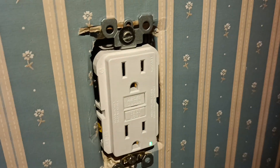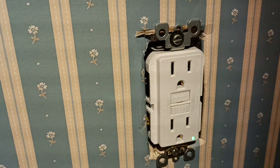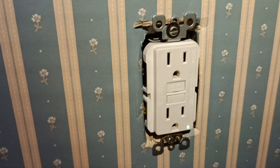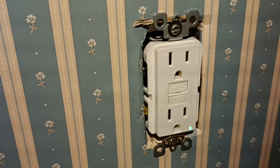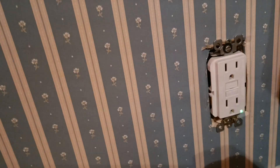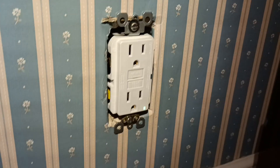Why would you want to put in a three-prong grounded plug instead of using just an adapter? Maybe you have a plug strip that needs a ground, or something that's requiring a ground. If your home was built before 1970 — I believe it was around 1970 or 1971 when they started requiring grounds on receptacles — your home would technically be grandfathered and you don't need to do this update unless there's a specific need, like plugging in a particular piece of equipment. A lot of things nowadays just run off two prongs, like USB dongles or lamp cords.